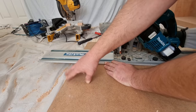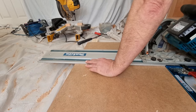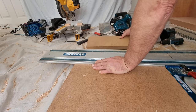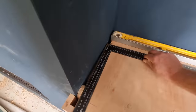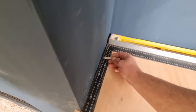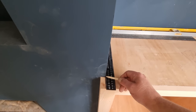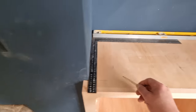Should really work off the face, off the front edge, because that's the square that I'm interested in. But this board is parallel, near enough. Now, back there, but if I cut this board square, it'll touch at the front. So what I need now is that measurement to there. I could go back, but you're working off a random point then. That distance is better.